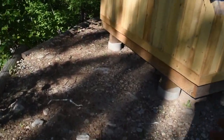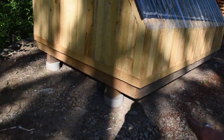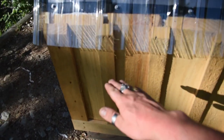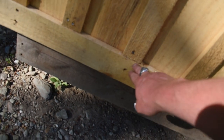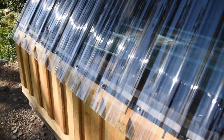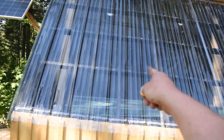Let's talk about what I would do differently. If you're going to do board and batten, add more blocking on the bottom row if you like that bottom trim look. On your south wall, definitely add a top row of blocking so you have a better spot to nail to. Add more blocking all the way around the entire perimeter and you're good to go. If you can get the double-walled panels with the air gap in between, go with that route. For seals, use new seals — I'm going to try expanding foam to seal up all the cracks and hopefully retain more heat. And don't use a tarp. Tarps are garbage.